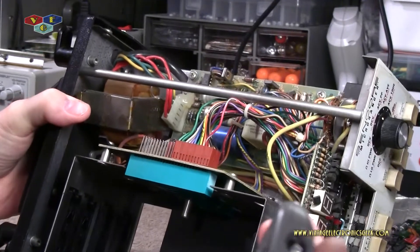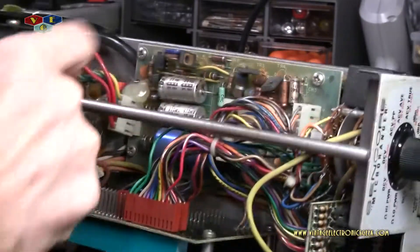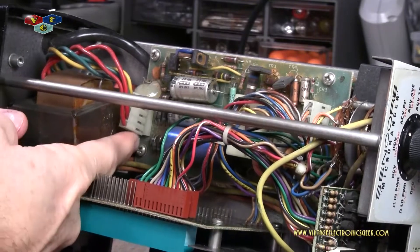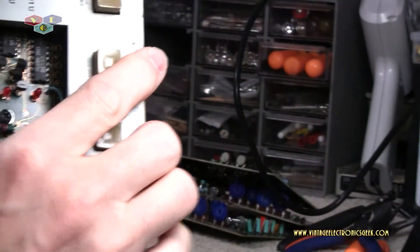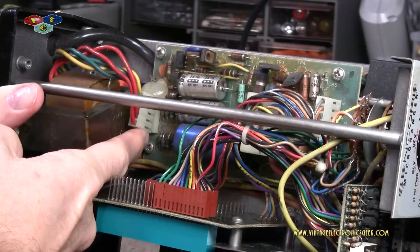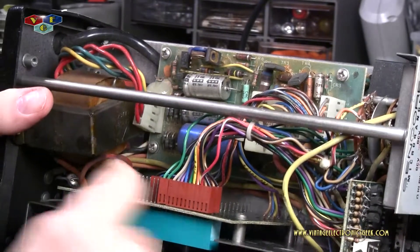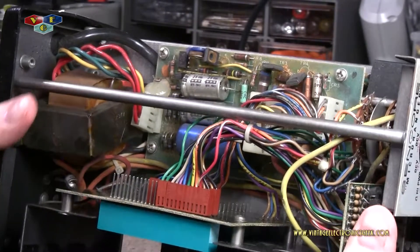Look at that power plug in front of the transformer. What you're seeing here is a bunch of hot glue on this end, and on this other end the power cable is not even seated all the way — we definitely have a good sizable quarter inch gap. So I'm going to pick that off and reseat that properly with no glue.